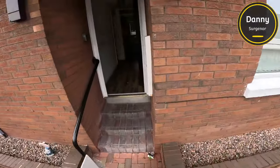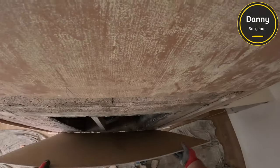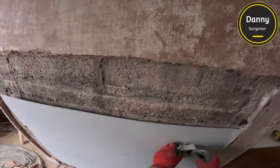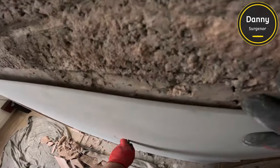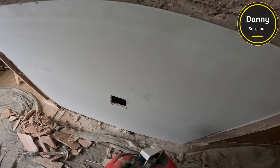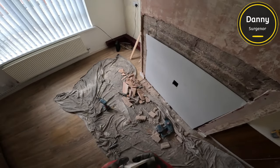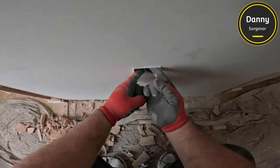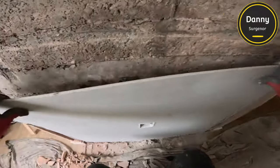I have one of the plasterboard boxes here and I cut it out of the plasterboard. I just hold it on and cut it roughly — I don't have to worry about it being straight or level because it's going behind an electric fire and will never be seen. We cut the shape of the box out, push it in, and put the little clips that hold it tight to the back of the plasterboard.